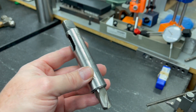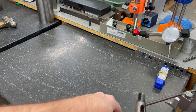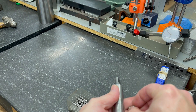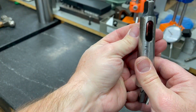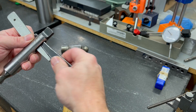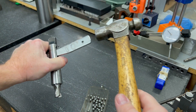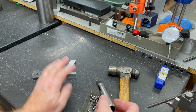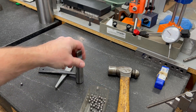There is a trick to get stuff out like this, and it's sad that I know what the trick is, but it involves ball bearings. What you do is take some ball bearings and put them inside. There you go. Watch out for the ball bearings — they kind of go everywhere. And that's how you get that end mill out of there.